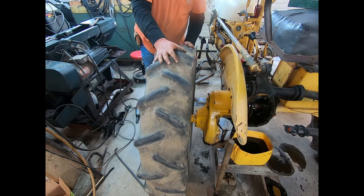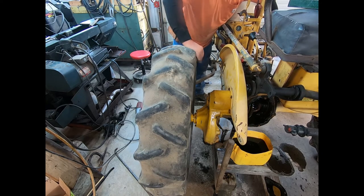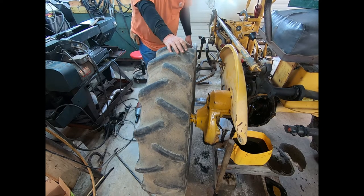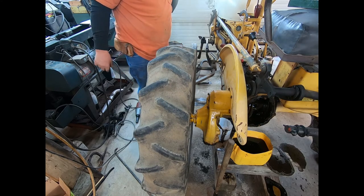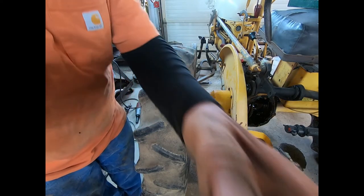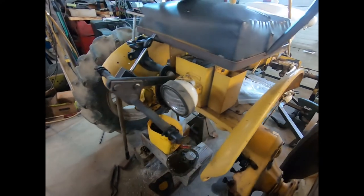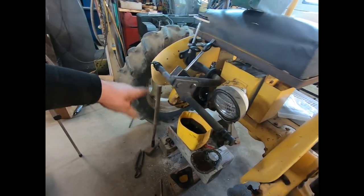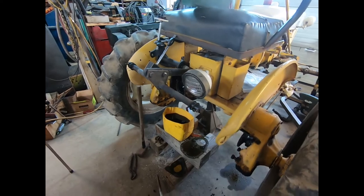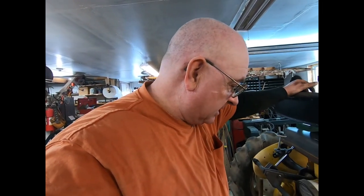Beautiful — one side done except for adjusting the brakes. Boy, those brakes do work good — that's going to be an improvement. I just have to bend over the cotter pins when I make sure both pedals are traveling the same, but I'm going to do that later. This other side isn't going to be as handy — got a few more bolts along the edge. I'm actually going to set this down, put that tire right on the floor, then come over and jack up this side. I hope that helped anybody trying to do that rear seal.